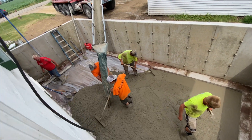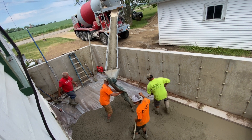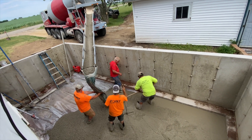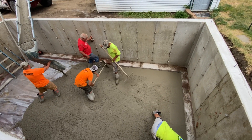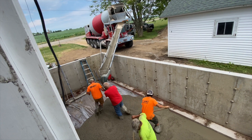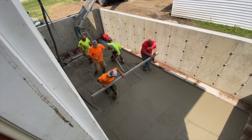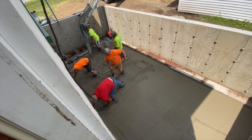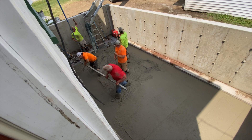This one was a little bit of an interesting foundation. Our frost walls need to be 4 foot deep, but grade here kind of was against us, so we ended up going with a 71 inch wall, or just under 6 feet. As with all of my additions that are on typical crawl spaces, I always quote to do a 2 inch slurry coat. This does a couple things: it's a much cleaner atmosphere in the crawl space — you don't have all that dust and stuff in the air and in your home. It also seals up radon, which is a big deal in our area. And it also helps to keep bugs and rodents in the house to a minimum. So I always quote to do it. That's why you can see the floor is actually inside the footing.